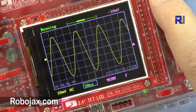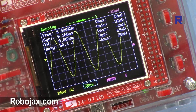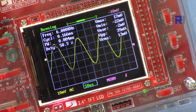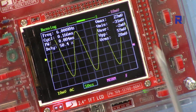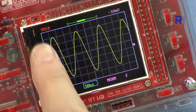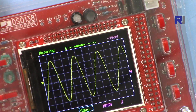To see measurement data about the waveform, press and hold this button — it displays the data and holds the signal. To see live values, press it once and all values update in real time. For example, you can change the amplitude and watch it update: 27 millivolts, 17 millivolts, 8 millivolts, and so on. To exit, press and hold to go back to hold mode, then press once more to fully exit. That's it — thanks for watching, please like the video, share it, and subscribe.